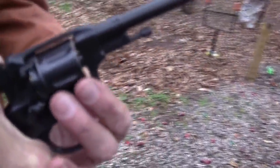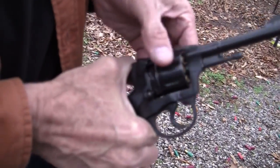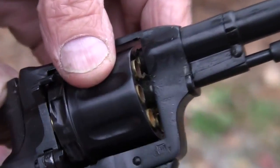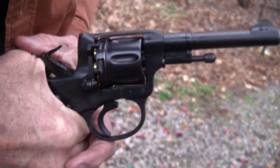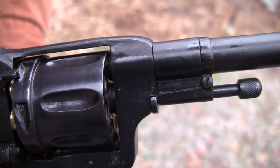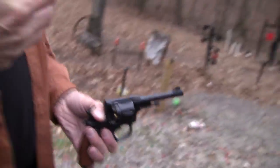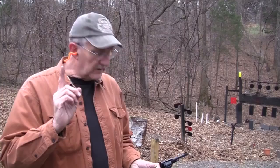I'll do a single action so we won't fire it — this is a weird little revolver. You don't have to put it on half cock, and you can actually turn the cylinder. Notice how the ends of those cases are protruding out the front of the cylinder — how weird is that? It looks like they're empty from a side view. Let me go ahead and cock it. Now bring it up there and notice what it does — you have that case sticking into the forcing cone from the cylinder, so it seals the gas. As that cartridge fires, the brass expands and it seals even better, so you get virtually no gas escape there.